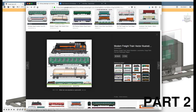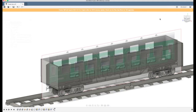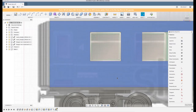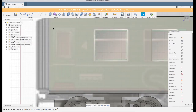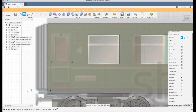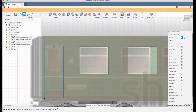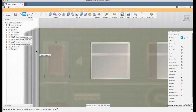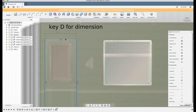Let's look at the pictures and see what we want to do. We want to do cutouts for the doors - that's one thing we need to do. I click the side, click create a sketch, and we can barely see the door there. I'll do the door separately, so I'll only make a big cutout here so I can make the door separate. You can see there's a blue line that lights up when I'm holding the mouse - that's the inner wall, because we have a two millimeter thick wall. It's important to try to make this hole so it cuts in the wall.